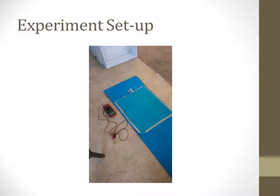While conducting this experiment, some assumptions were made. We are approximating the water in the bag as a flat plate, and as such we won't be losing any heat through the sides of the bag, but entirely through the top and the bottom. The felt was taped to the pad to prevent any heat from leaving through the edges. The felt was also wrapped as tightly as possible over the plastic bag to limit the volume inside of the pad and felt enclosure. We assumed that the ambient air temperature was equal to the temperature of the surface of both the pad and the felt, especially once the temperature reached steady state values.